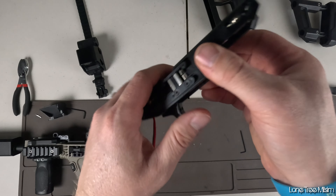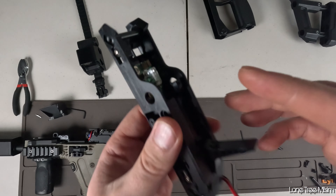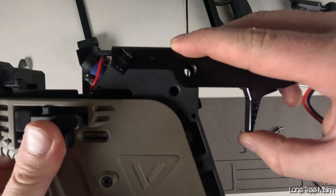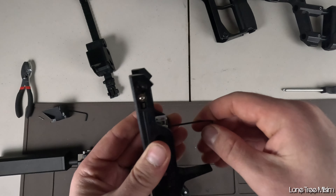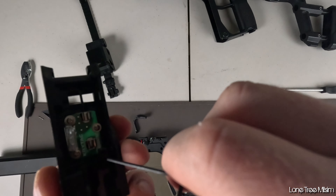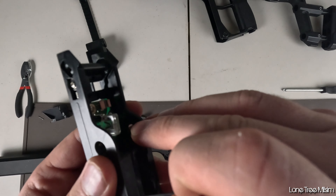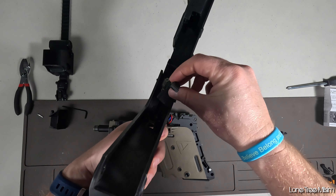At the front of the speed trigger assembly you'll see a little Allen key — this will let you adjust the pull of the trigger. You want to make sure that it fits just right. You can test it by installing it like this and then pulling the trigger to wait to hear a little micro switch click. If you're not hearing anything, adjust the distance with the Allen key so that you can get a tighter pull.